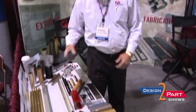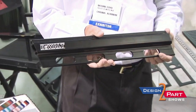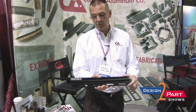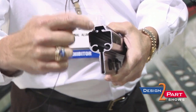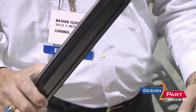This would be an example of a nail gun magazine for DeWalt Black and Decker nail guns. You can see that the profile has been extruded in this direction, and once we've extruded it, we can take it and do the CNC machining — and that's primarily to remove some weight. The important thing about this is that from a dimensional standpoint, this has to be all within line here to allow the nails to slide in and not bind when people are out doing projects.